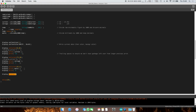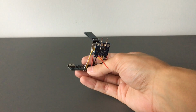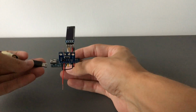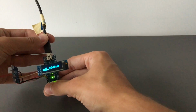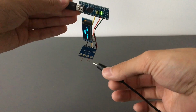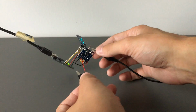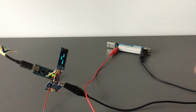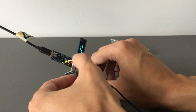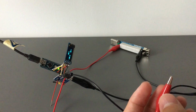So yeah, let's turn it over to the table. First of all, we're going to power the Arduino. If I can get the wire. All right. As in the schematic, we're going to take power ground, supply ground, and connect it to in negative over here. Then we're going to take that over to a burden resistor, which is this one here. We're going to take it to the resistor, and then the other part of this will just go to the positive end of the supply.